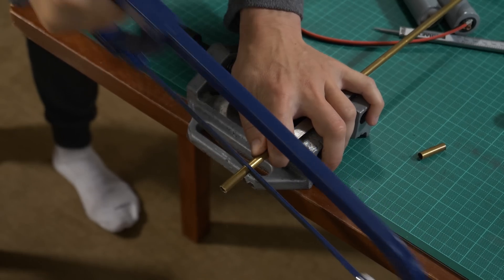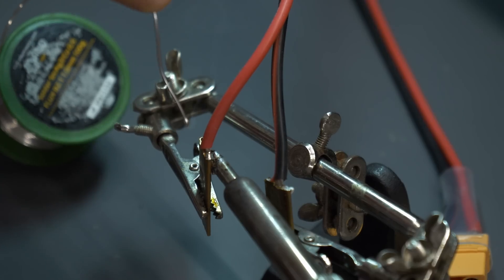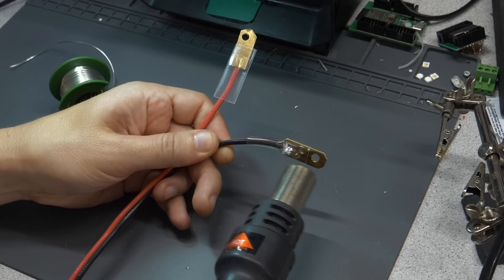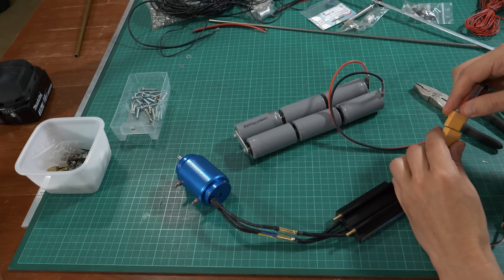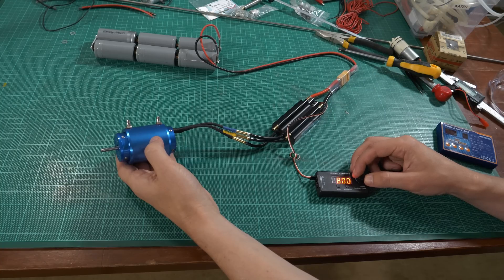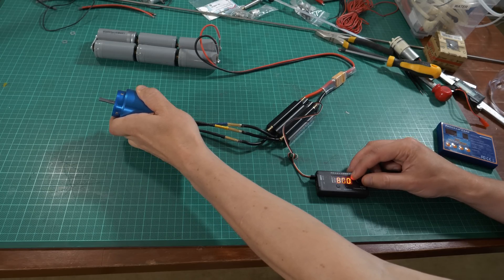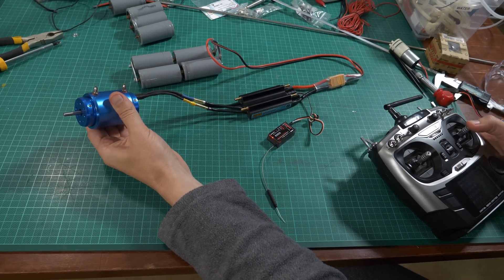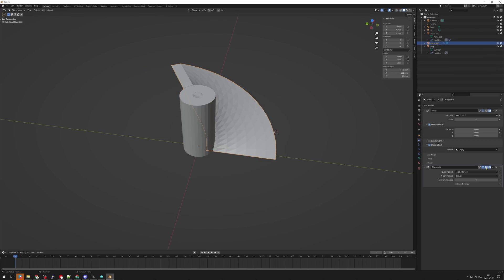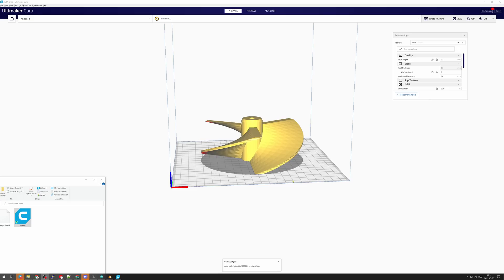A nice trick to make your own connectors is to take a piece of copper pipe and squish it. Setting up the controller turned out to be annoying — I wasn't able to set a speed with a regular PWM input; that would just change my controller modes. It needed to be a PPM signal from a remote or a microcontroller. This somehow turned out more and more complicated. As the next step I started to design a prop and kept it really simple — a rotational model of three blades, not optimized but easy to print.